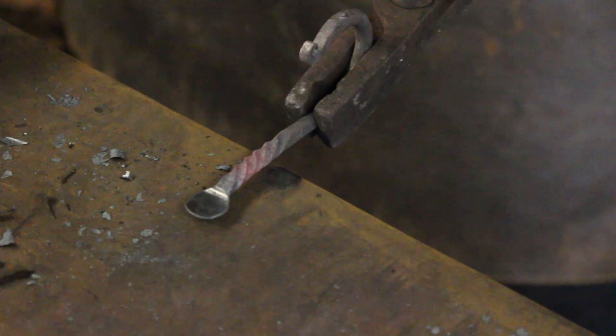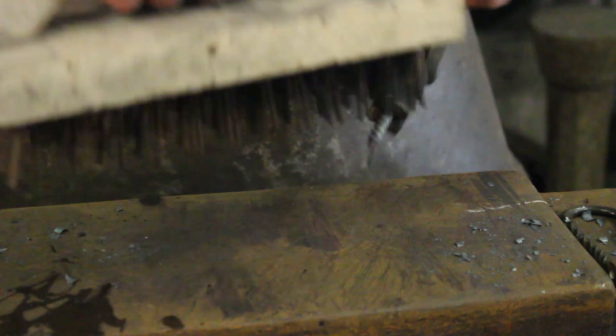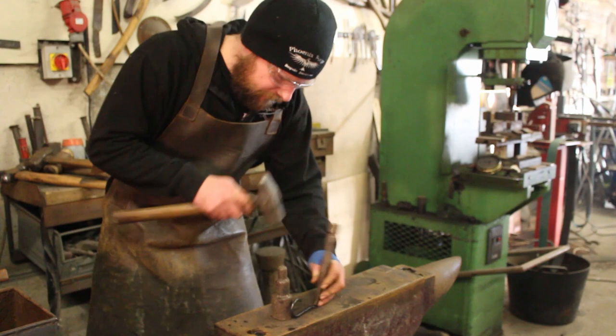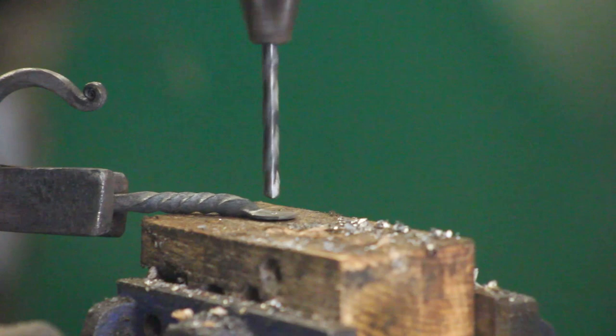All that needs now is to cool down, drill a little hole through there, and that should be good to go. While I'm waiting for this hook to cool down ready to drill it, I can grab a wire brush and get rid of all that excess scale, give it a bit of a polish and tidy it up. Hopefully by the time I finish brushing it'll be cold enough to hold onto with my fingers. Try and get your center punch mark in the middle — if you don't, you can always walk the drill bit. So there's my finished J-hook, nicely done, nicely polished up. Great to be making these in batches of 30, 50, 100 — it will really speed you up, get your hand-eye coordination in for your hammering and generally improve your skills. It's a really great first project for beginner blacksmiths and they sell really well too.